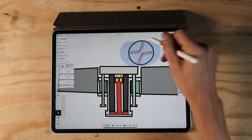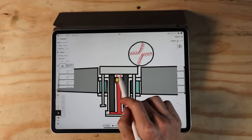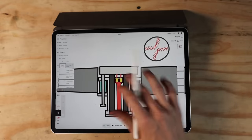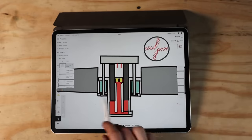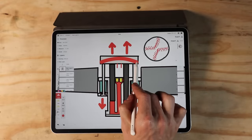So here's what I think happened. A ball came in and just barely hit the corner or edge or something, which was enough to fire the system. As the system started moving, it just kind of pushed the ball to the side, and then it was free to shoot out like a rocket. This made it slam into the stop springs much harder. So they were pulling down super hard this way, which bent it into this very annoying potato chip shape.